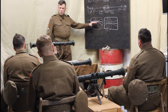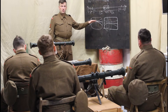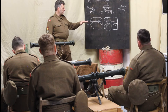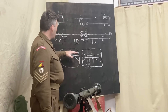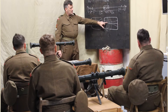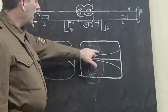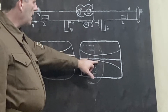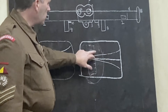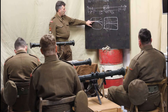One of the adjustments you need to make using the halving adjustment head — which is under the left lens on the left side — is to make sure these are equal. The incorrect view has a bigger gap between the middle line and the top than the lower line. This is a hill or the crest of a slope. What we need to do is make sure that the gap between the top and bottom is correct.